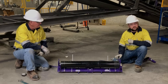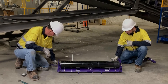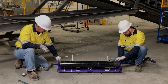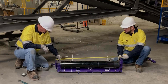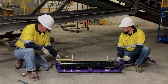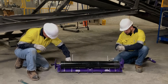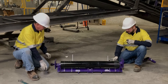Now we need to adjust our extending brackets to match the measurement we took earlier. To do so, we're going to need to back off the set screws and then extend the brackets out and take a measurement to get us to 47 and 3/8. Check to make sure the brackets are extended out the same amount on both sides — two and a quarter on each side — and then we can secure that back with the set screw.